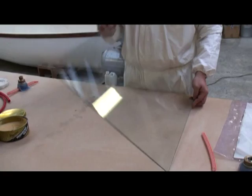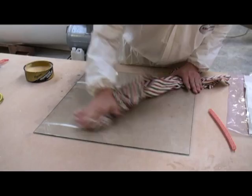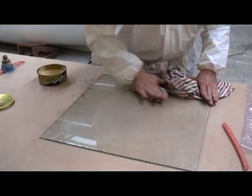We're going to be using a polyester resin, so we need to ensure that the laminate doesn't stick to the mold tool. We're using a standard mirror glazed wax in the normal fashion, making sure that we have a good even coating of wax, leaving a border around the outside of the panel so that our sealing tape can go on and make sure that we get no leaks underneath it.